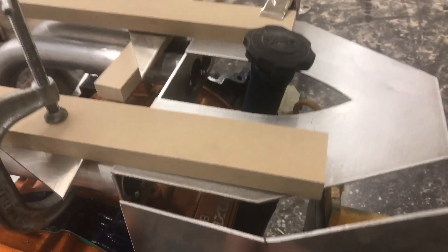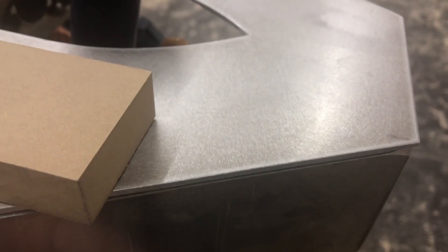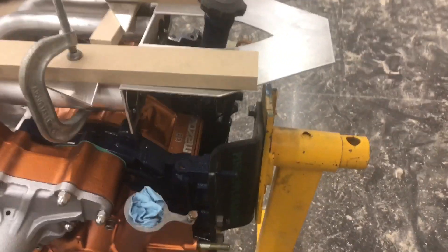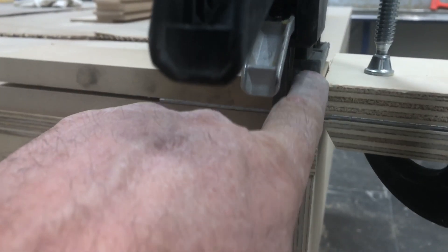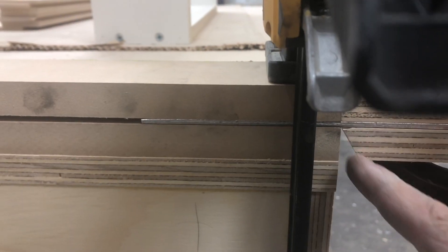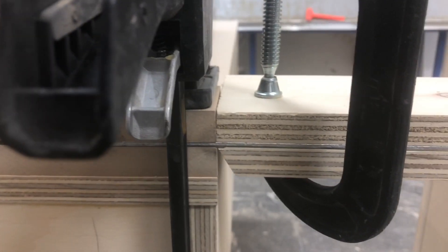I bent this one piece here — I'll show you. It's going to fit in right under there for that side. Turned out pretty good. I'm a cabinet maker, not a metal fabricator. So I clamped it down with one leg right here on the edge of the bench and put the clamp right out near the edge with a board on it so it holds this down tight to the bench. Then I cut the angle that I want on this board right here, put it underneath, put this board on top to give me a little bit of leverage, and then clamped them together.